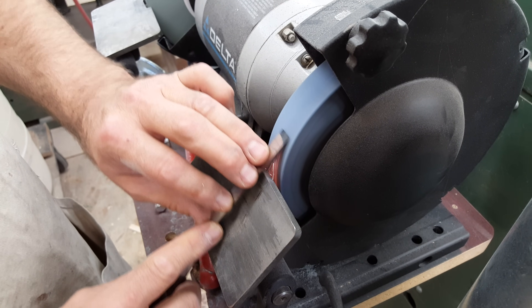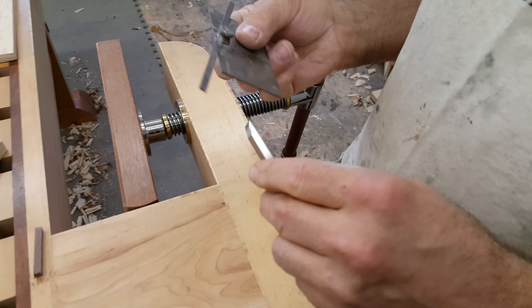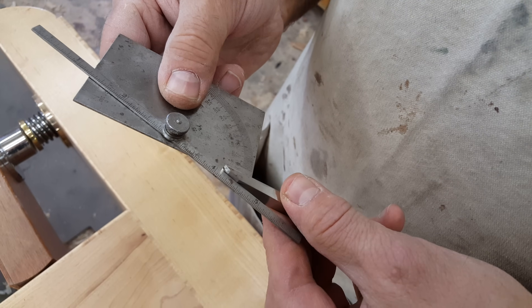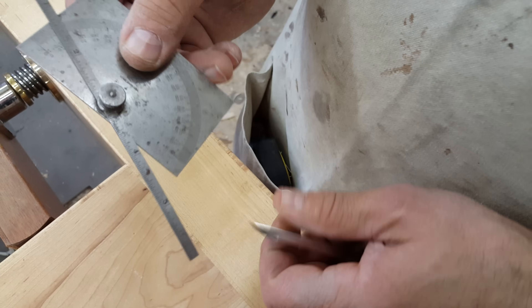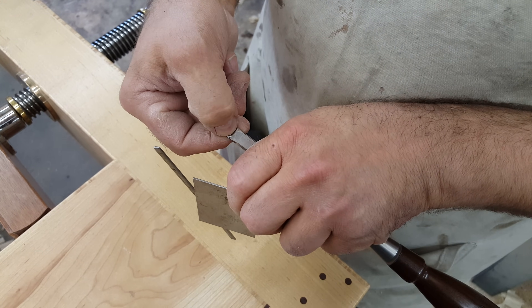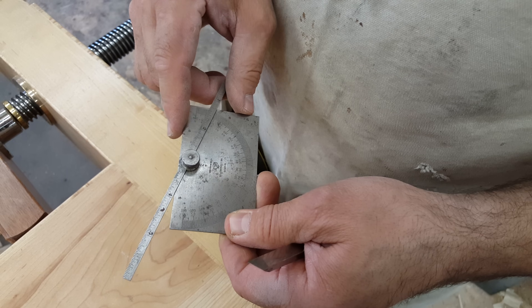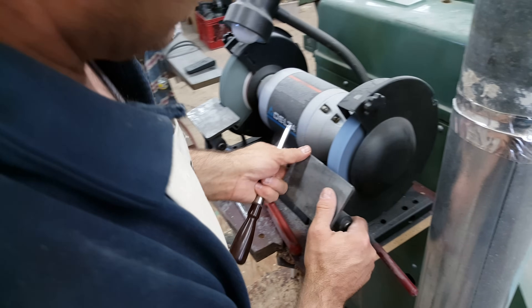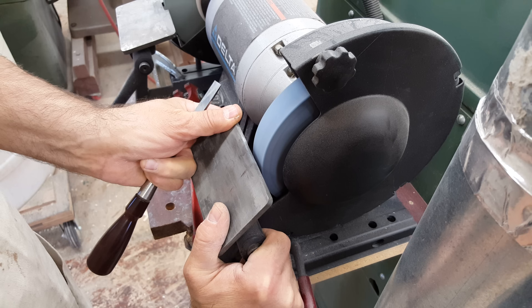When I get enough ground that I can register with the protractor, I'll check it again and see if I'm close to that 17-degree angle. I'll adjust the tool rest if needed. I'm just pushing it in until it touches across that flat part of the bevel — that section I've already ground. And that is showing up as just above 21 to 22 degrees. So I've got to take this heel down a little bit more and adjust this rest, pull it up a little bit higher.